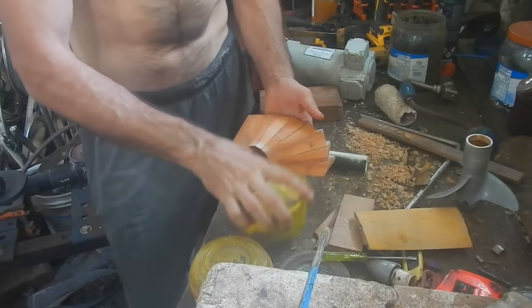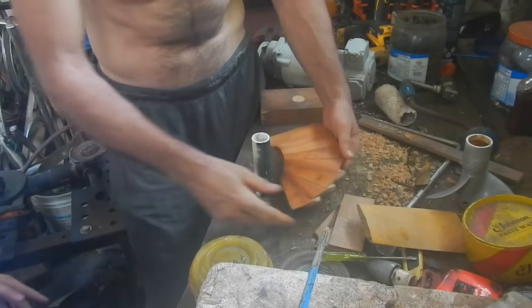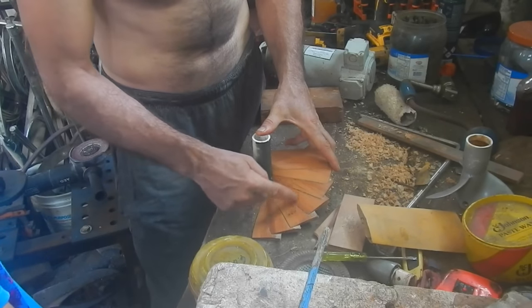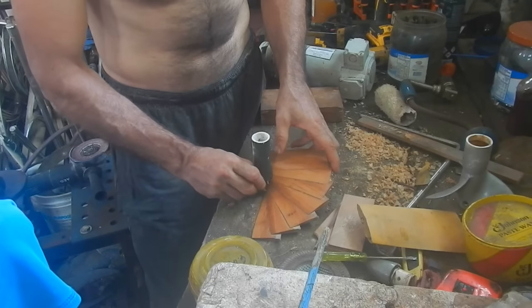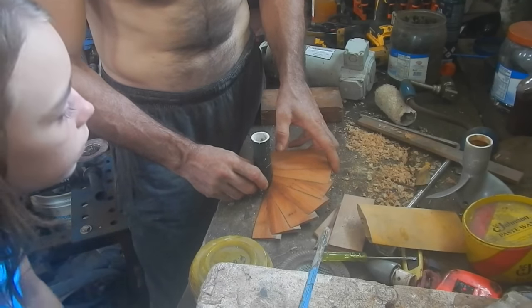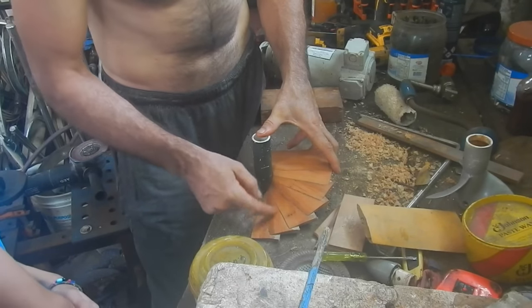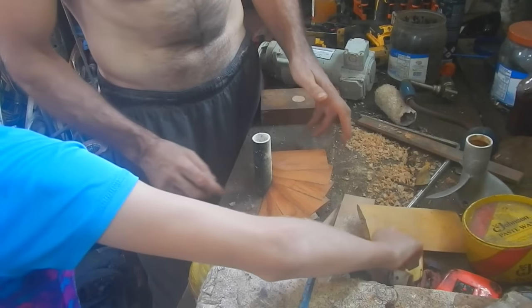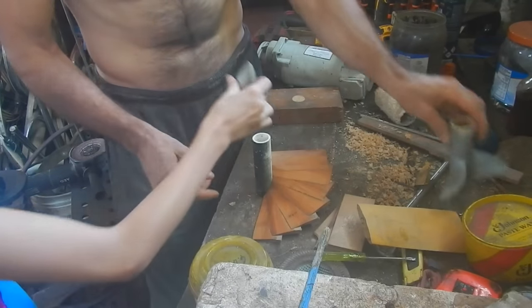You want to know how this thing works? This is the piece it's attaching to — I've got to make sure I don't get wax on it. I'll put a piece of fiberglass in the shape of the propeller right there, attached to this. Then I'll rotate it — 360 divided by 3 is 120 degrees — and make another one. Then rotate it again and make another one. Three propeller blades total. I'll make it pretty much like this one, and this part will stick out the back.